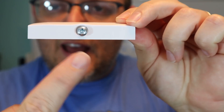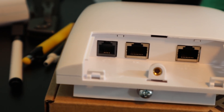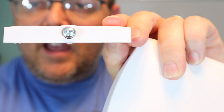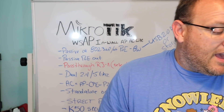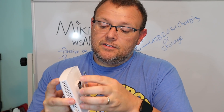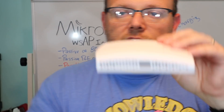On the bottom of this — this is the cover — it's got a standard Phillips screw in there. What you can actually do is order the K50 security screw set so that people can't just be opening this access point. You can use the knockouts on the bottom — there's a knockout here and a knockout over here — to provide an ethernet cable out for connectivity, and then lock it up. The way the mounting system works is it slides in through the back, and once the unit is all sealed up, unless someone pries it off, there's really no way to get it off the wall without breaking it.